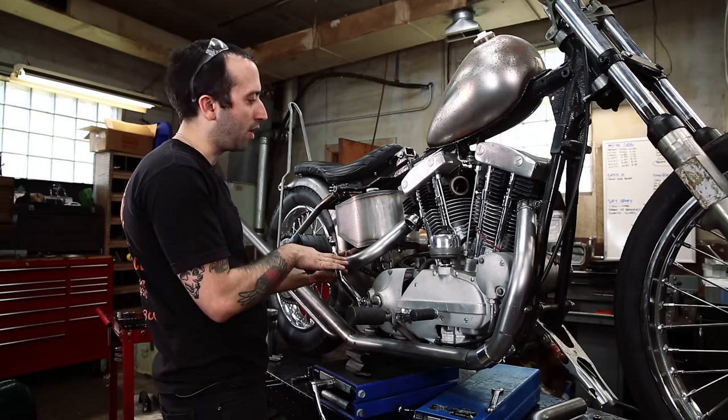As you just saw, I had to cut this joint apart and rotate it just a bit so that the pipe was parallel with the other pipe in the rear part of the motorcycle, so it wasn't coming out at an angle like it was before. I used the angle finder again to match the angle so that the exhaust and the frame all stay parallel — a super useful tool for doing something like that. The only thing left to do with the exhaust, besides weld it up, is mount it in the rear. The plan is to use a couple of tabs off the bottom of the exhaust — one to the axle plate, maybe one off the frame, and another off the sissy bar in the back.